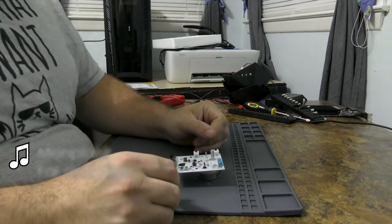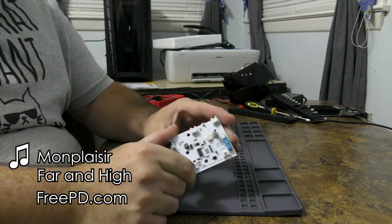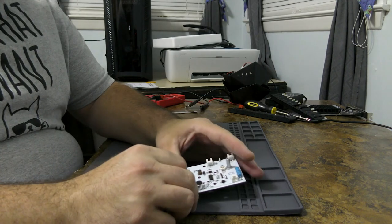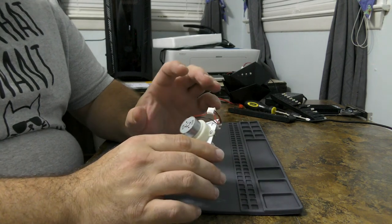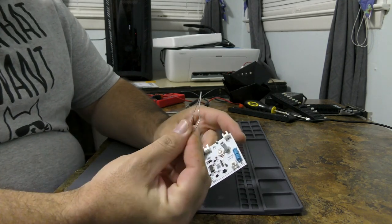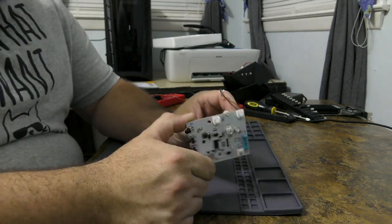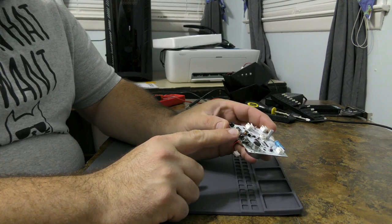Alright, this video serves two purposes. This is the circuit board from one of those $10 star and wooshy LED pattern lights from Walmart. Pretty sure this IC here has failed, or never worked in the first place, because it's brand new and it doesn't work. I tested the motor, which doesn't run, but with voltage, it runs. The LED here, I took this paper clip and shorted across the transistors, and the LED goes at full blast. So the LED works, the motor works, and the laser has always worked. The buttons don't toggle anything.